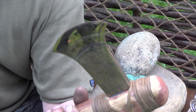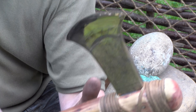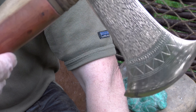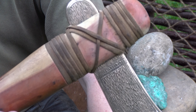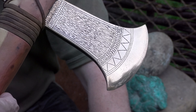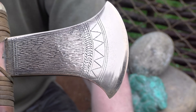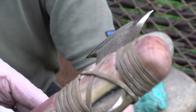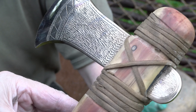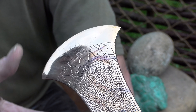Anything that these guys have made — let me step around here, flip the screen around, and I can show it in really super close 4K. So the part that you guys are involved in specifically is this blade. It's modelled on one that was found just outside Bradford. It's an early Bronze Age flat axe. The original would be about 4,000 years old. They're cast in a stone mould flat and then cold worked into the final shape, with all the decorations put on by hand afterwards.